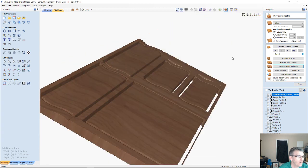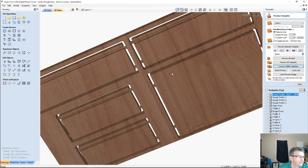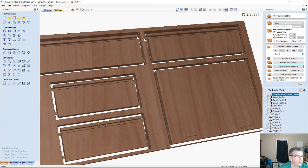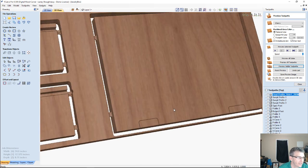But if we flip over to the other side, we've got our bottom of the box grooves around our parts. We've got our box lid with our hinge mortise. You can see that hinge mortise there. I'm going to have to do a little chisel squaring, a small little square cut on each of the two corners here for that square hinge. And then